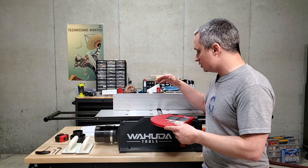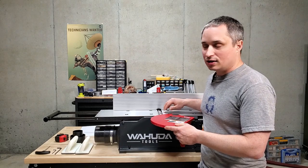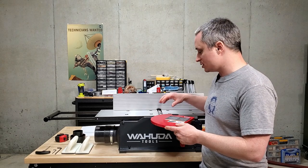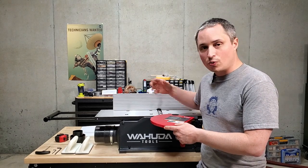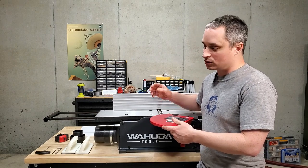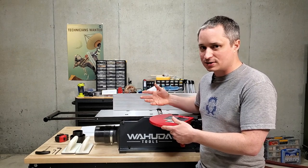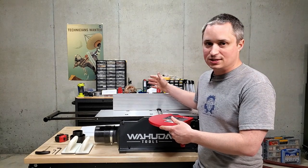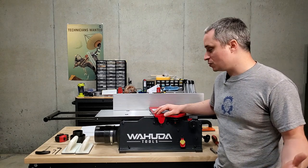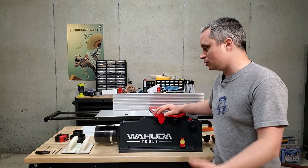The third reason was the spiral carbide cutter head. Instead of having straight knives all the way across, it has indexable ones that you can flip four different times if they get worn out or nicked. With a straight knife you might have reversible knives you can flip once, but if anything along that whole width gets a nick in it, you've got to replace it. So next we'll start off with a tour of the jointer controls and how to make adjustments.